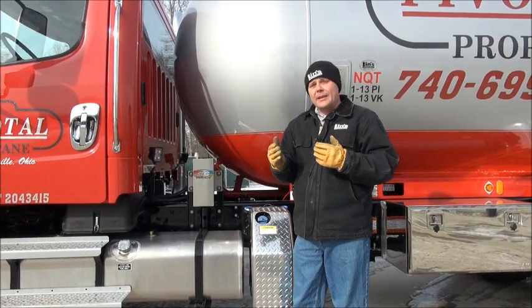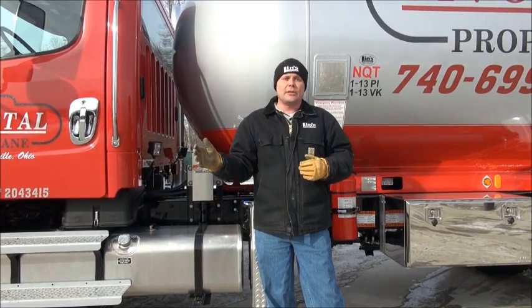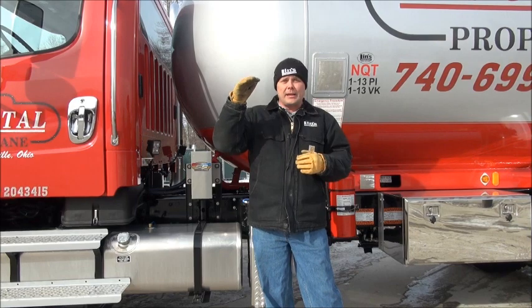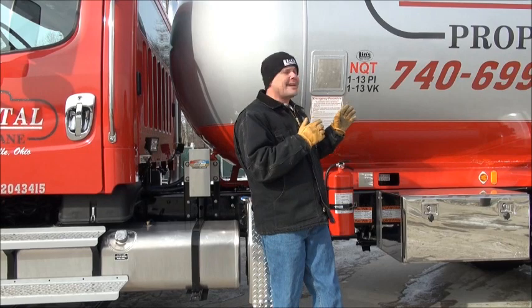And what does that in turn mean? It means more gallons per minute. If you stabilize the tank, your gallons per minute isn't going to drop off like it does on a normal truck as you get into your delivery. It's going to stay right up at the top of the line gallons per minute — same when you started as when you finished. You can pump the entire truck off and you're going to be at the same gallons per minute as when you started.